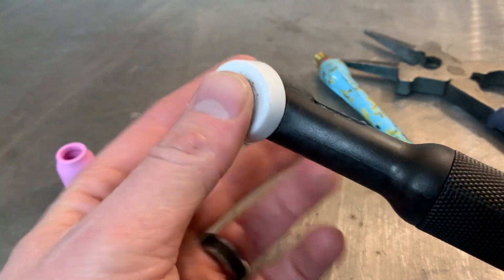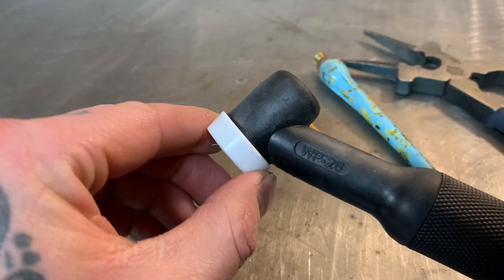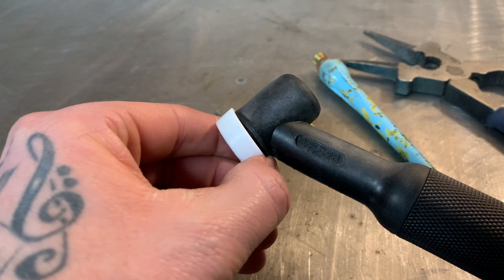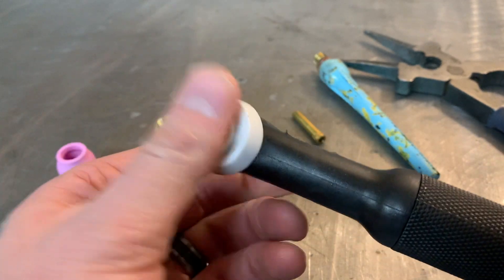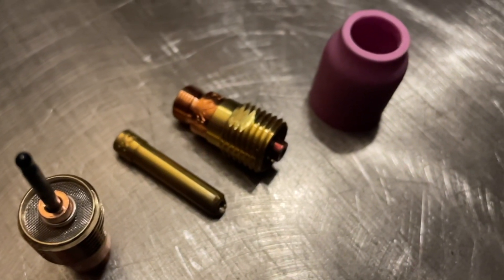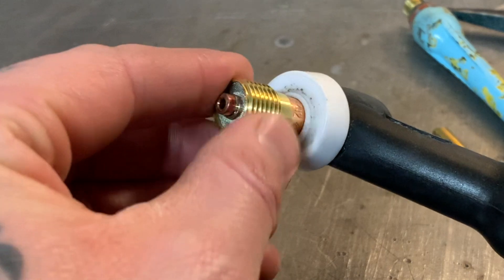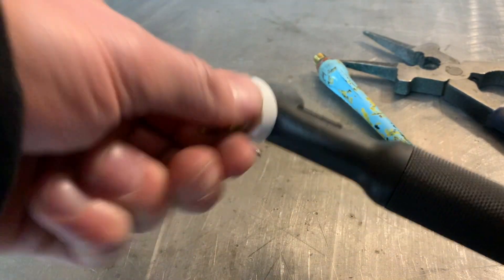First thing I usually do is make sure that my adapter is seated correctly and firmly. If you're ever welding and you have an adapter askew slightly, before you know it you have gas leaking out somewhere. So you always want to make sure everything is seated firmly right off the top. The next thing I use here is a gas screen — this is a 3/32 gas screen. It threads in like so, and you want to make sure that this is seated firmly as well.